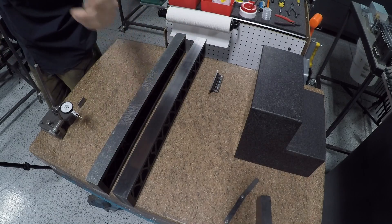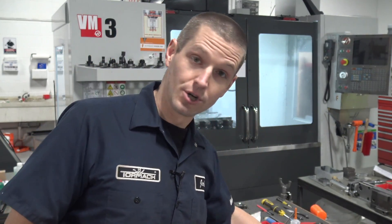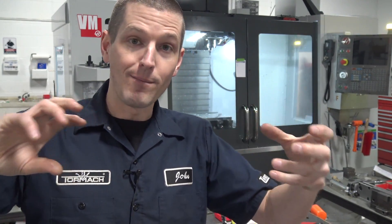Then I found out about surface grinders. I thought that's what surface grinders do — they go back and forth and make things incredibly flat. Well they do, but they don't. There are some drawbacks. It's a complicated machine that can have tram error or wear, especially as the table moves left to right. You're also holding the work piece down — whether with a vise or a magnetic chuck — and that induces stress and may twist the part.